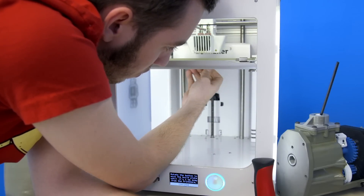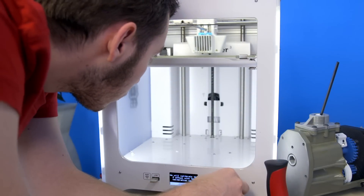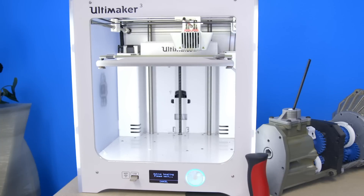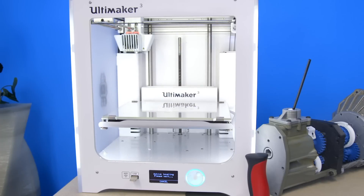What I've found works really well is to tighten down all of the bed leveling screws on the bottom of the bed, loosen them about one turn, and then do a manual bed leveling. That usually brings it back to a point where the bed isn't super skewed, and then you're just relying on the automatic bed leveling to pick up the remaining slack. The automatic bed leveling is way more precise than just turning a couple of screws, but turning those screws gives you a good blank canvas to work with.